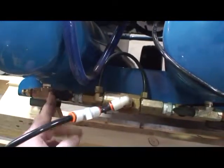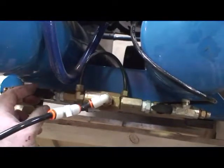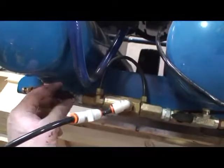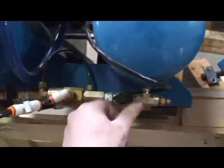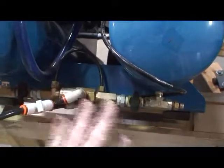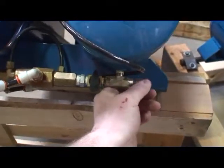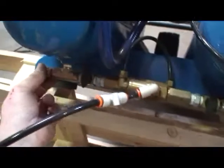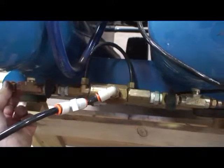If you're experiencing issues with these drains, they don't have to be used. They're easily bypassed by doing the following. Simply turn off these valves to the up and down position. That's now isolated this entire drain setup. Now you can go back and use the manual tank drains to drain your tanks of any effluent at the end of the workday.